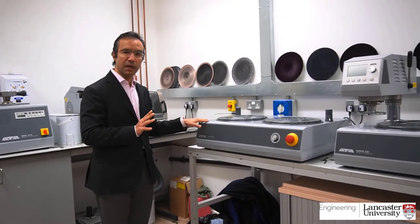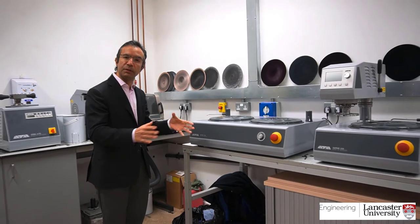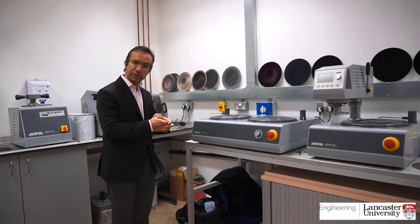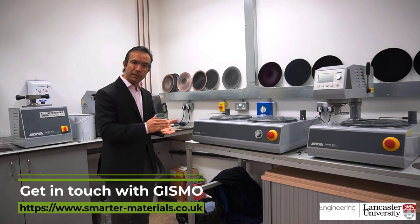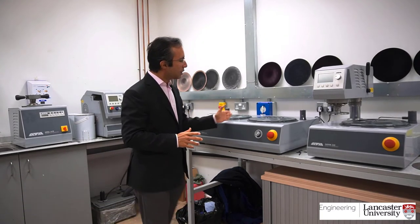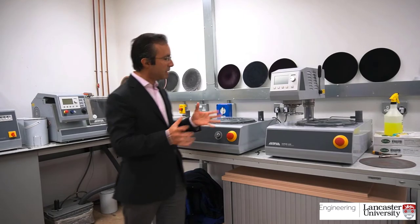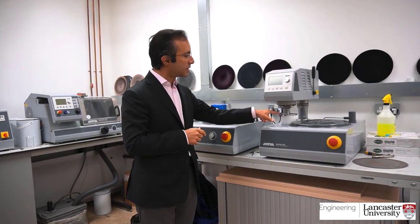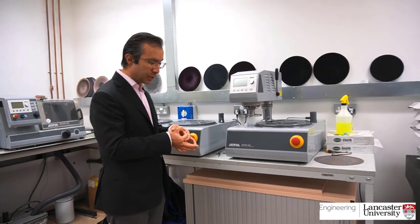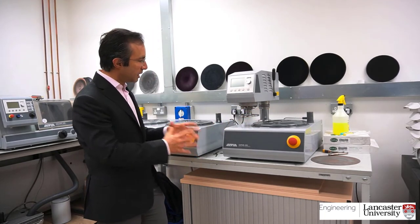Here are the polishing disks that allow us to do that. The polishing disks are essentially disc-shaped sandpaper with a different number of particles per unit area. When there are a lot of abrasive grains, you create a smoother surface because you rub them with small pieces of sand. We can do it at various steps, from coarse to fine-grained sandpaper. But this can be done automatically — here, for instance, we can mount up to six of those small samples, and this is a kind of robot that can perform simultaneous polishing of the samples.